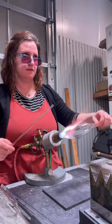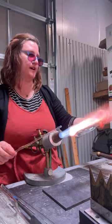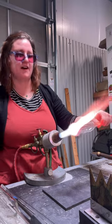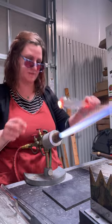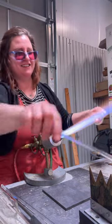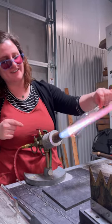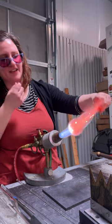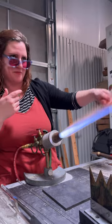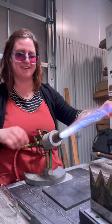Are you going to flame polish? I would tell you to, but I just don't want to burn my mouth, because I'm going to blow. If I was doing production prep work, I would just polish it, but since I'm going right into it, I wait maybe a minute or so, and then I bucket it in water. Oh, that's smart. It's a little counterintuitive, I stick it far enough into my mouth so that it doesn't make contact with my lips. Yeah, but you could cut your tongue. Making sure my tongue's not in the way.